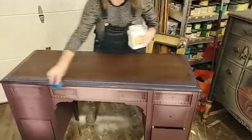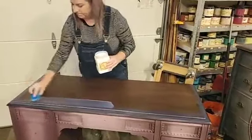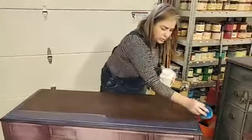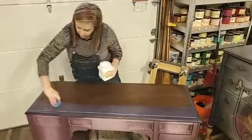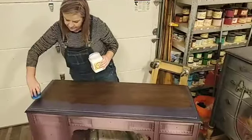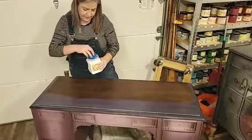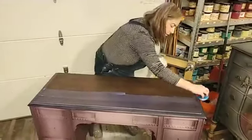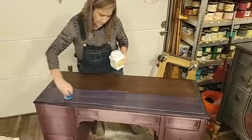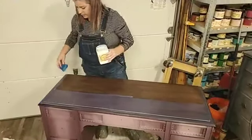You guys saw how fast that was. I don't have a super long time. This is satin clear coat. And I could even do, so I told you on a wood top, I'll usually do 4 to 5 coats, because this is raw wood, guys. A painted surface, you got to think that you've got the protection of the paint plus the existing finish underneath. This had nothing. I took it down to the raw wood, so it does take me a little bit more clear coat on raw wood tops. I'm going to create a streaky finish in this so I can show you guys.